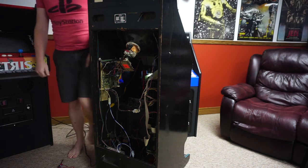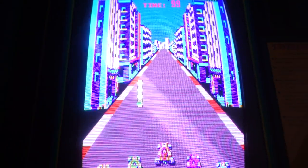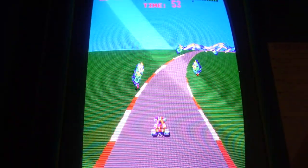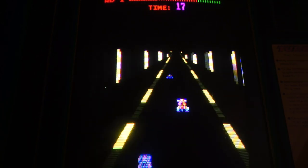I hadn't even bench tested this K7000, so thanks, eBay seller. I can already tell the brightness is much improved. I flipped the horizontal yoke connector to correct the orientation, then adjusted the focus, brightness, and colors. I was easily able to achieve bright brights and dark darks. Finally, look how well the screen maintains brightness when exiting the tunnel to the ice road. I'm calling this a great success.